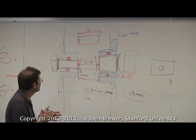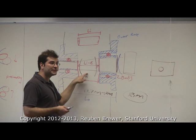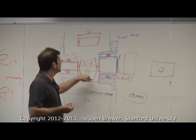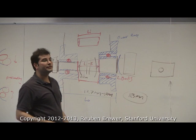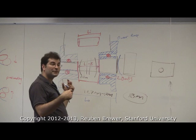I'm trying to get you to see this sucks, but I'm not doing a good job. Basically, if I install this in the plate, then I have to install the Belleville washer and the spacers, like these shims, and another Belleville washer. Then I have to install this bearing. And I believe the shims are 14 millimeters in diameter, but this is a 22 millimeter diameter hole, which means my shims are going to be nowhere near the center. So then I have to stick my shaft through and do ring around the rosy where I get every single shim through it. And I have to do this as I install this bearing from behind, because remember, I'm compressing it with the bearing installed.